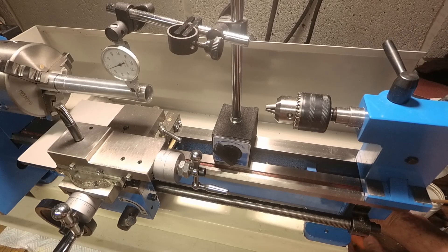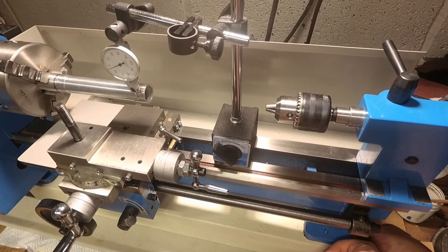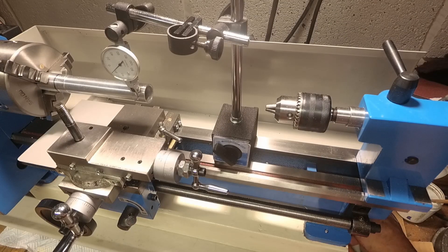That's the far one snugging up now - that's quite tight. That's the near one snugging up now. You can see the dial's moving a smidgen, but it hasn't moved a thousandth of an inch yet - just 18 microns, about half a thou. I'll live with that. It's probably going to need to be shimmed if I do a taper test anyway. See how it goes.